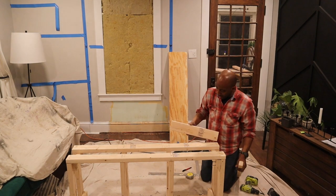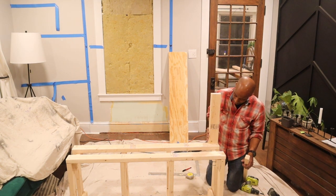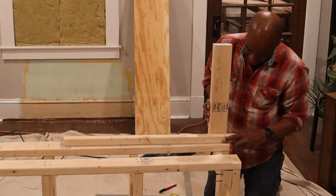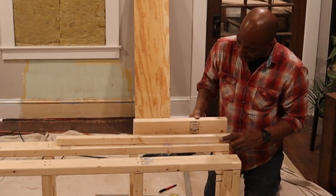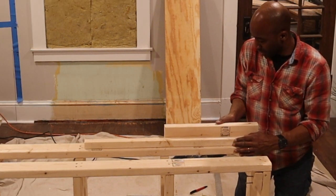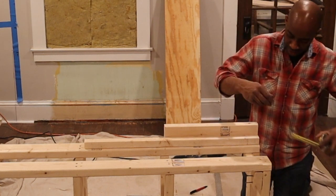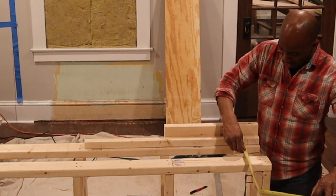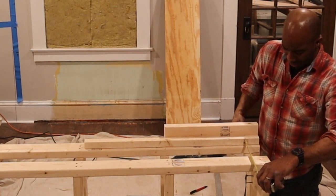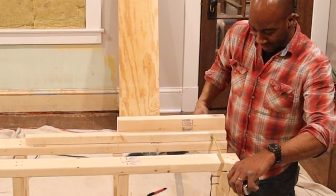I know my top half is going to be upright just like this against the wall, and it's also going to have a stop at the very end. So I'm just going to lay this down because the measurement still stays the same. So then you can connect this to the studs? Well, I'll know exactly where the end of my heater is. The manufacturer says it's 8 inches. Well, 7, 7, 8, so I say 8 inches. It's going to come right up against that stop right there.